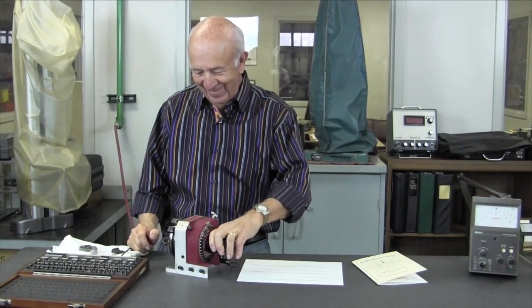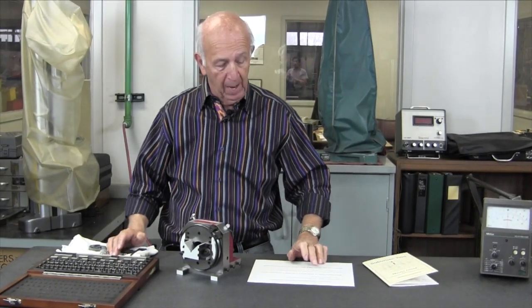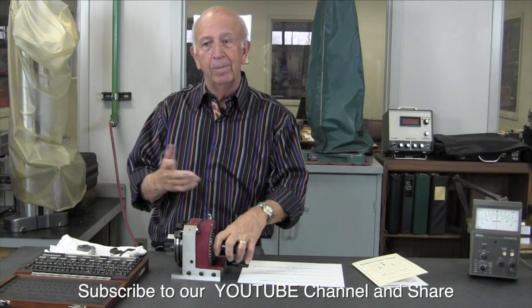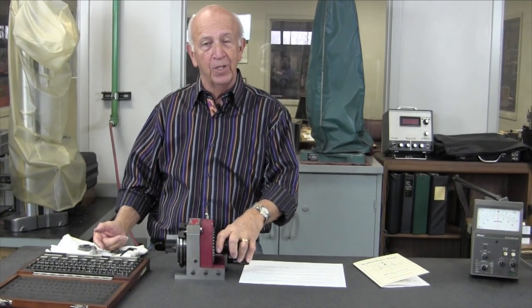That's how you get two degrees — pretty simple. So that's the way we do it. If you want two degrees, remember you don't have gauge blocks for two degrees, which happens to be 87 thousandths and two-tenths — not going to work with a set of gauge blocks. So the way to do it is to add another five degrees, giving you seven, then take away five here, and you end up with two. Five from seven is two — pretty simple. That's how you set a master grind for two degrees. For those of you that inquired on it, I hope this will be a helpful video. Thanks for watching.